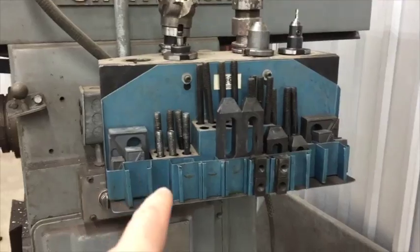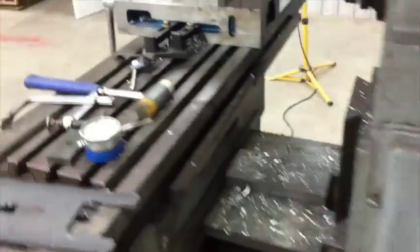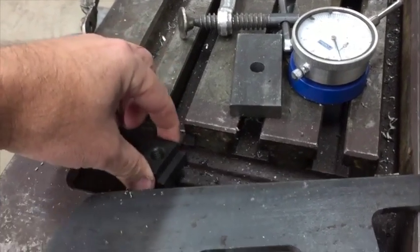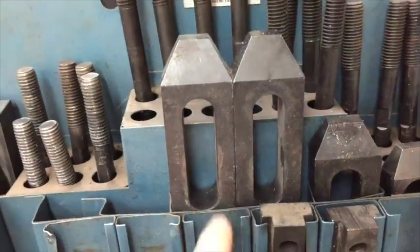And so what's in here is the larger. In fact, these T-nuts don't even fit. I'll have to mill those a little bit. Actually, yeah, that one's going in. They wouldn't fit on the other end. I'm guessing it's just tight and debris in there is why it's not fitting. But those will probably work. These are 1/2 inch 13 bolts, and I think these are 5/8 T-nuts.